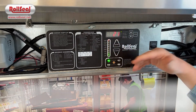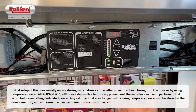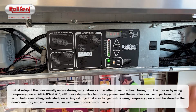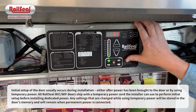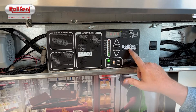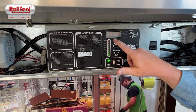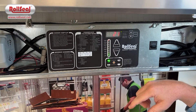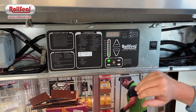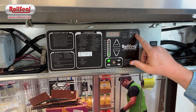You'll get three dashes, basically meaning that the door doesn't know where it is at present — it's had power cut. So the first action it needs to take is to go open and find home. As you visually look at this controller facing, you'll see that this section matches our switch card on the door track exactly. You've got the same LEDs with your error codes, open and close buttons, and you can activate the door from here. Then you've got some toggle switches and a mode button.